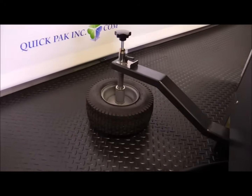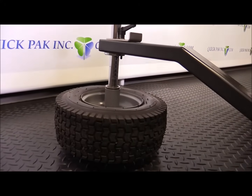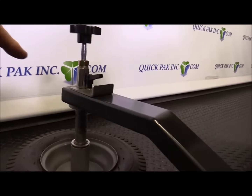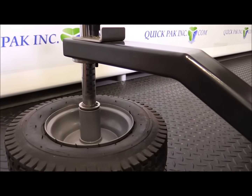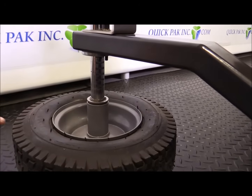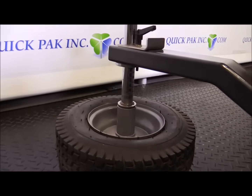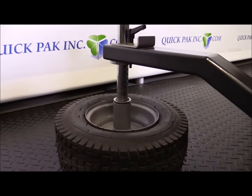Here we have the guide wheel and the guide arm. This is what tracks the pallet, and it's spring-loaded. It can be adjusted — there's an adjustment at the top — allowing you to set whether this tracking wheel tracks the bottom of the pallet, somewhere around three inches from the floor, or some customers have it tracking the product that's on the pallet, depending on the type of pallet and personal preference.